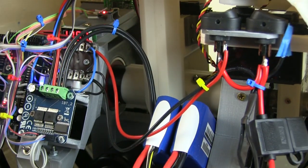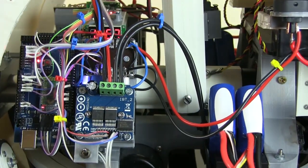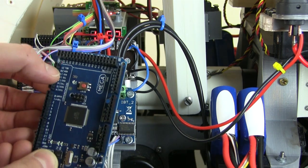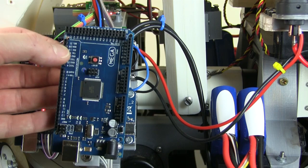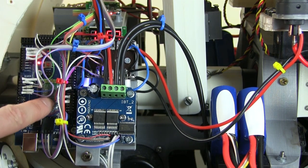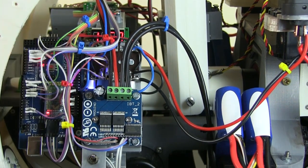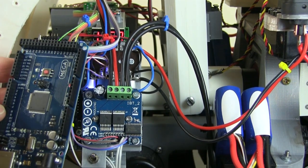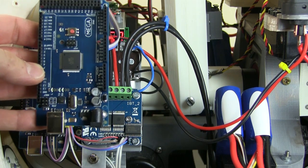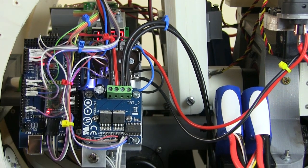I've wired quite a few things in. The MPU6050 is right in there with its power light on, wired into power and to the I2C pins. I've got another Arduino Mega — the top two pins on the left are the I2C pins, which have to be wired the correct way around and are labeled on both boards. The other pins are the other UART serials. The Bluetooth interface, piggybacked on here with its red light flashing and stuck to the Arduino with tape, is wired to the second UART, RX1 and TX1. RX0 and TX0 are wired to the USB port for programming and diagnostics.